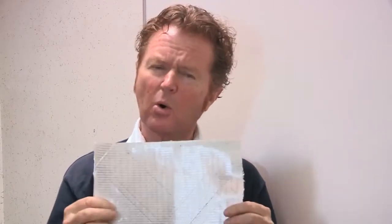It's important that we build up our repair to the same thickness as the existing structure. We know that we've got a repair that is 2 millimetres thick. We're going to use a 450 gram per square metre biaxial glass fabric — incredibly strong but also quite thin. Our 450 grams equates to roughly half a millimetre of finished thickness, so we're going to need four layers of this to build up to our existing 2 millimetre laminate thickness.